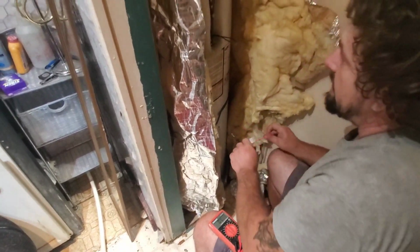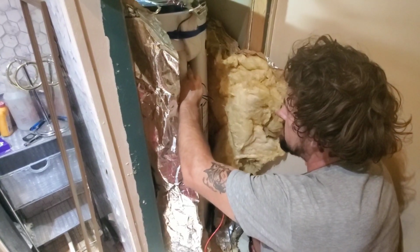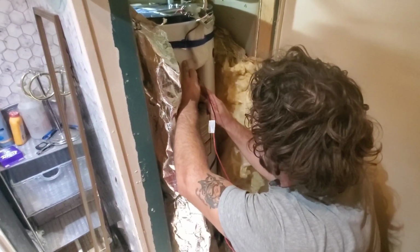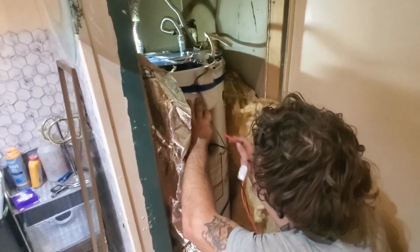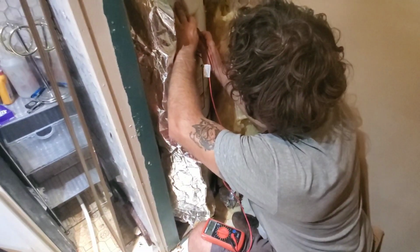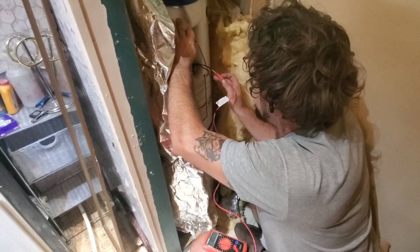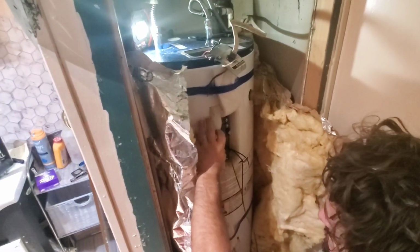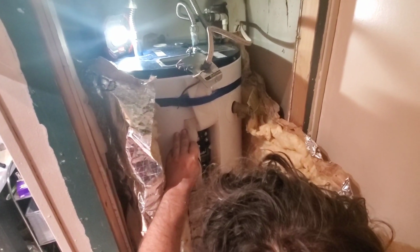And we're good there. Now, as far as this one, we checked our thermostat. This is a reset button, okay? We checked our thermostat. So our 120 coming in, we have supply here, so that post is working. Then we go over to this post, and we're going to check. Sorry, neighbors, my gimp shoulder won't work. We test this one, and again, we're almost 0. And see there, no. But we go there, no. But we come back over here, and we see we're supplying. So currently, when we touch this post to our top element, the power is running to work our top element first.